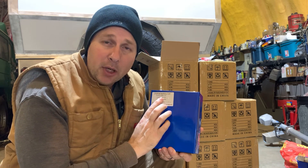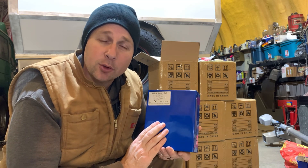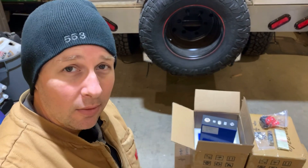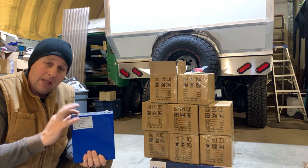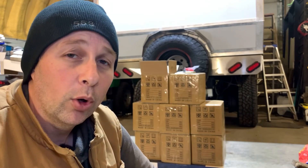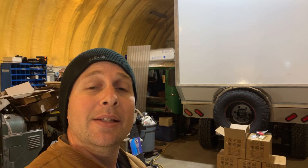LiFePO4, or lithium iron phosphate, is a type of battery cell commonly used in solar storage, electric vehicles, and portable electronics. It's important to understand the difference between cells and batteries. These are cells. Cells consist of a few key components: the anode or negative terminal, the cathode or positive terminal, and an internal electrolyte. Electrolyte can be something as simple as salt water — it's a substance, usually a liquid, that allows ions to flow between the cathode and anode. This flow of ions inside the battery is the other half of the electrical circuit driving your components on the outside of the battery.